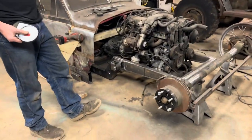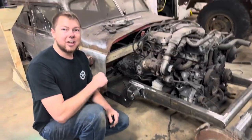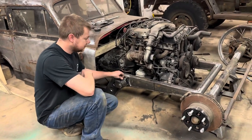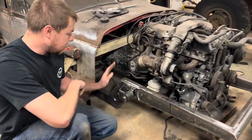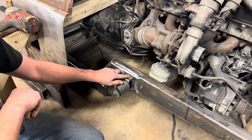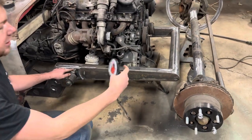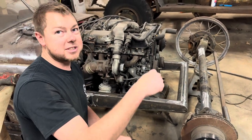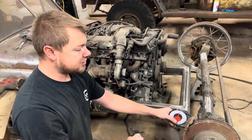The floors are so beautiful and clean you could eat off them, even though they're stained. Not for long. All I've done is sleep while Cory's welding all that up. We got the brackets all welded up and tacked to the frame. Now we've got to find the caster of this axle. We got a gauge finder — the proper way is to pull both ball joints out and run a piece of pipe through it, then find our caster that way.